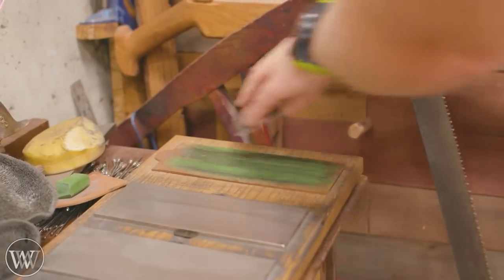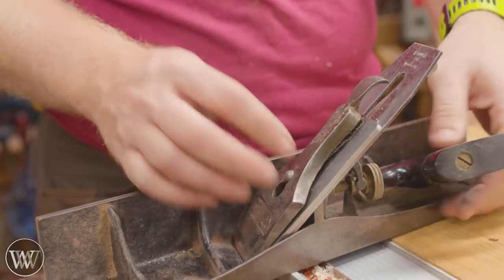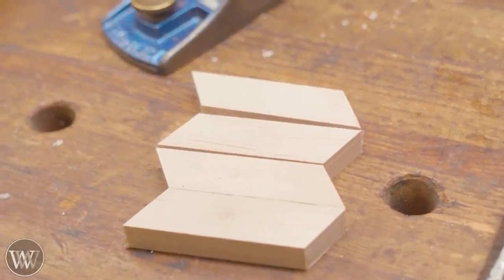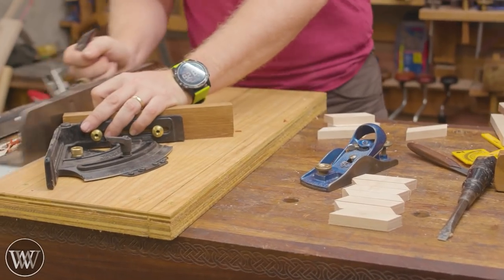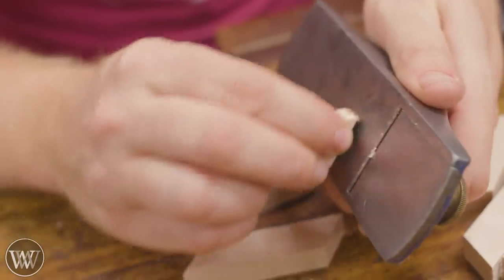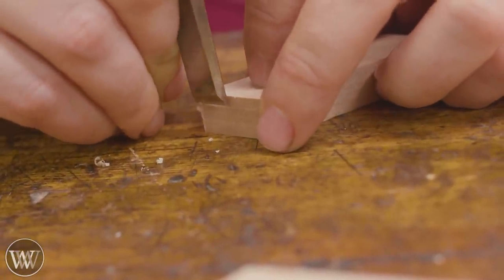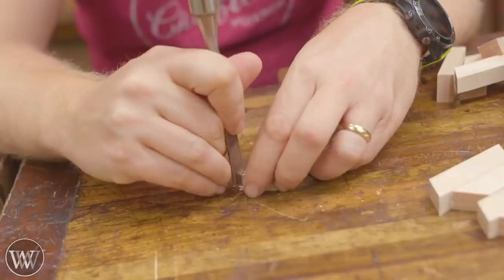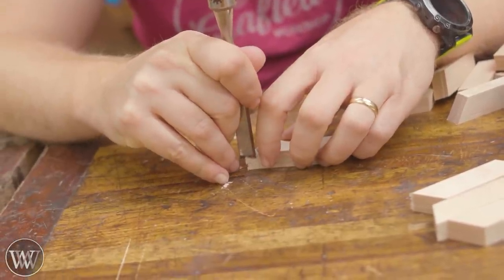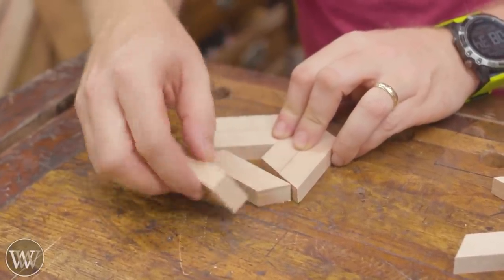The shooting plane was getting a little dull so we need to sharpen that up. I'm trying to show every sharpening in a video, though the shooting plane is really only sharpened once every few months. Now that these have all been shot and are the same size, I ended up with a little fuzz on the ends because the shooting board stop wasn't quite exactly where I needed it. I tried a block plane but found the easiest thing is just to trim it down with a chisel. These don't have to be absolutely perfect because the corners will all need to be touched in just a little bit so they don't run into things.